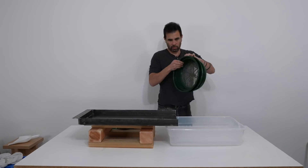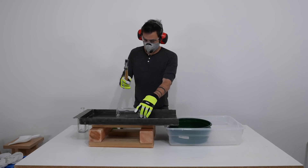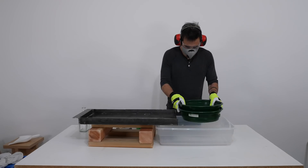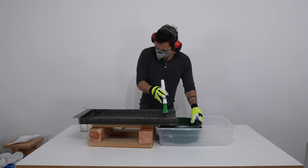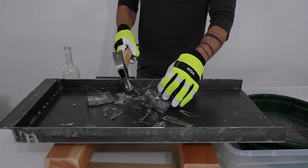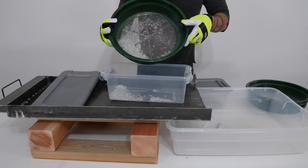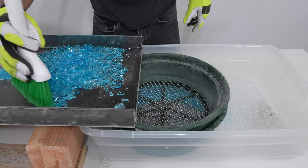This did mean spending some time removing labels off beer, wine, and beverage bottles. I welded up a steel tray and got some sifting devices with different sized meshes — typically used by prospectors. After donning safety gear I broke the glass bottles with a hammer, covering them with a steel plate so glass wouldn't fly everywhere, then sifted through stackable trays: the top with quarter-inch holes and the bottom with eighth-inch holes. This gave me nicely sorted glass gravel in two sizes. I kept a couple of blue gin bottles separate for just a little bit of blue glass.